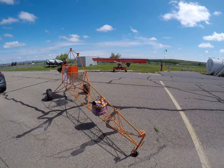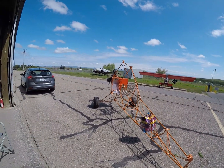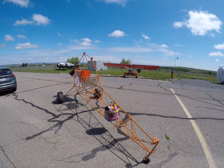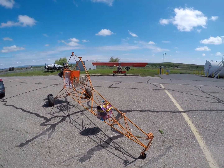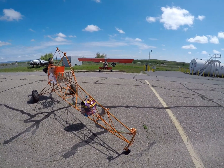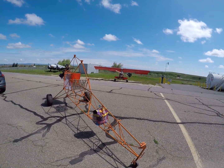The first thing to note: every tube in this except for the landing gear — from the frame down to the wheels — is 0.028 wall tubing. The 0.028 wall tubing is a little bit more difficult to weld, it's lighter, somewhat easier to work with, bends a lot easier, and it also crunches and does other things a lot easier.